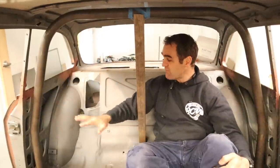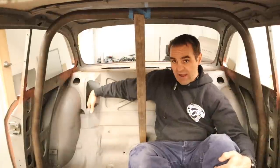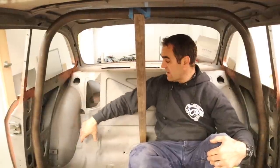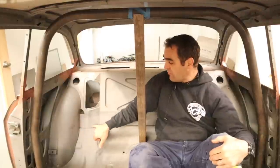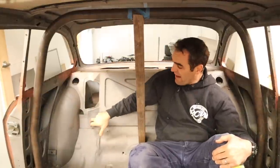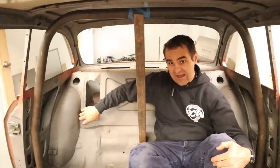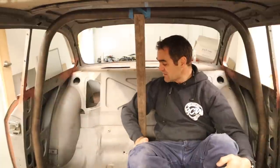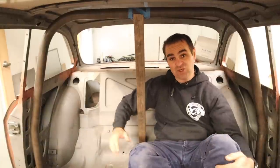Some cages in 105s they put onto the wheel arches — I'm less of a fan of that. I'm looking at going right through this hole here, which is where the rear suspension mount bolts in. That inner rail is one of the strongest parts of the rear of the car. I'm going to run the rear bars from the cage directly down to this panel. Like the base plates last week, I'll do a plate mounted onto the car and a plate on the base of the cage that bolts onto that. The plate welded onto the car needs to be 60 square centimetres.